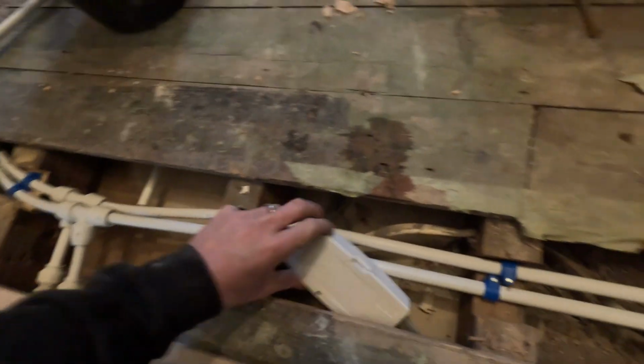We just cut this out and I just put this in a maintenance free box. Really shocking, because actually if you look at this cabling, it's new cabling and there are new spots in. So grey cabling, I think the regs changed on colours in 2007, I think. So it's not good, is it? I mean, the kitchen's not old downstairs, so therefore it's been changed fairly recently. Somebody's just changed some wiring and just left that mess on the floor, which is a bit shocking, really. No pun intended.